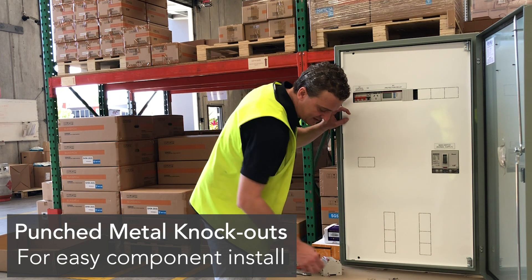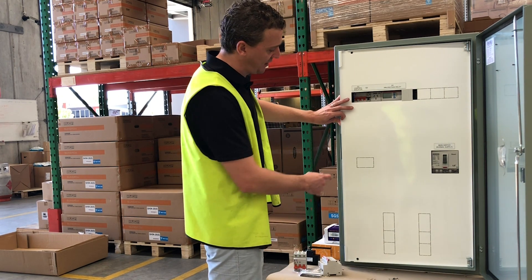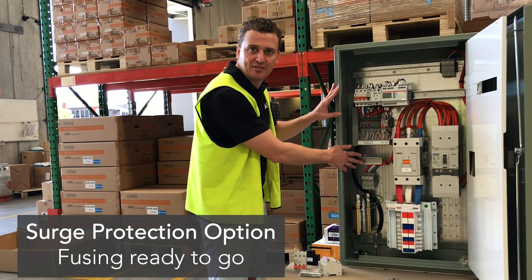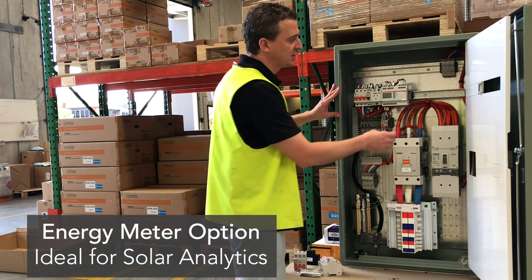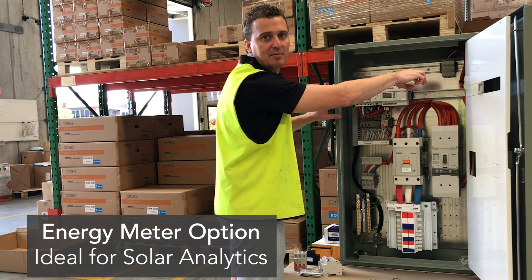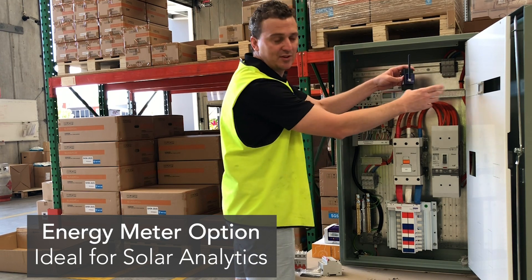You just knock out three of these points and it comes with all the proper etched labels to be able to mark up those AC points. This point here is for surge protection — you can see there is DIN rail mount for the surge protection with some fuse points that can wire straight into it. Similarly for monitoring, we have some cartridge fuse filled points here to connect straight into hardwired metres. And if you are using something like what we recommend, which would be the Solar Analytics, that would just clip straight in here and come through the escutcheon.